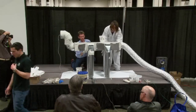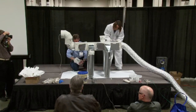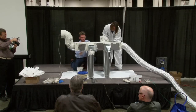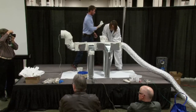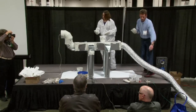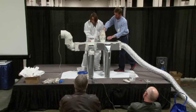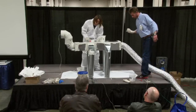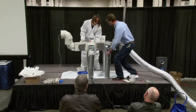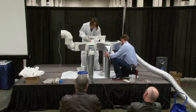The question was: can you use the tape and the mastic? And yes, of course. Just for this demo, we're going to stick with the mastic. We'll typically do both. A lot of times for all those standing seams, we just go with the tape because it's one quick long shot. There's also on this trunk line actually two seams — you can't really see them — but before we'd put the takeoff runs on, we'd actually just tape the full trunk line and then put our takeoffs on.